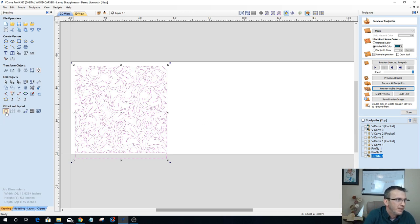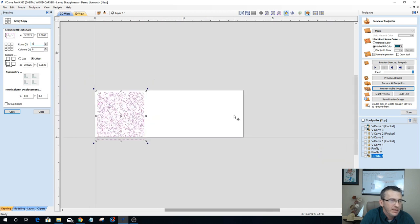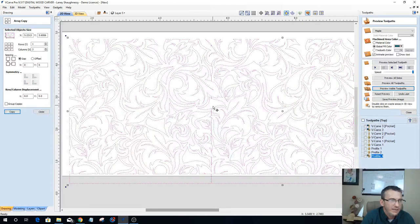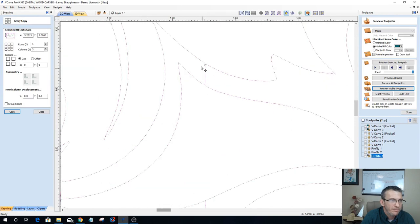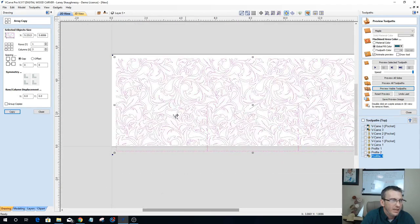a continuous flow. So I'm going to use my array copy tool here, and I want one row, and I'm going to go 1, 2, 3 across on the columns, and for my spacing, I'm basically going to use a gap, and my gap is going to be 0 on each of the parts here. And when I create this, that'll create this kind of seamless pattern. Now where those two patterns come together, we have a little joint here, and we'll go ahead and clean that up in a jiffy. So